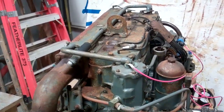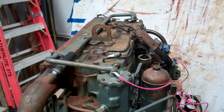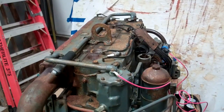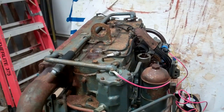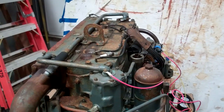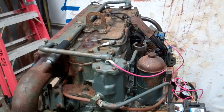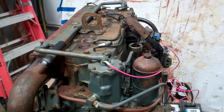Robert Henkel in Marine City, Michigan — Chris Craft Parts, Peter Henkel Incorporated — will be receiving this engine in a couple of weeks. We've got a crate for it, so we'll load her into the crate, tie her down, and coordinate with Robert to have him tear this engine down and give us a report as to what it needs. My guess is it's time for a complete rebuild from top to bottom. We'll also swap it over to 12 volts at the same time to get better starting performance for her owners.